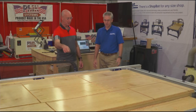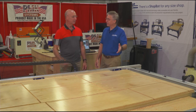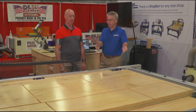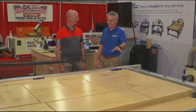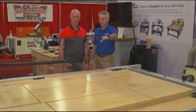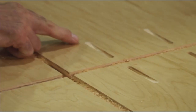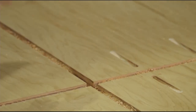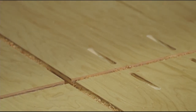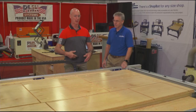Tell me again how many inches per minute we were running at on these profile cuts. We saw 500 inches a minute — full depth pass, with a three-eighths bit. That is incredible. A 100% complete cabinet, ready to go to your edge bander, pocket holes, shelf holes — all in under eight minutes. The addition of that pocket hole, kind of a fluting cut there — just like a pocket hole, we ramped down to full depth at the end. What a great time saver to not have to go to a pocket hole machine when you come off your CNC.